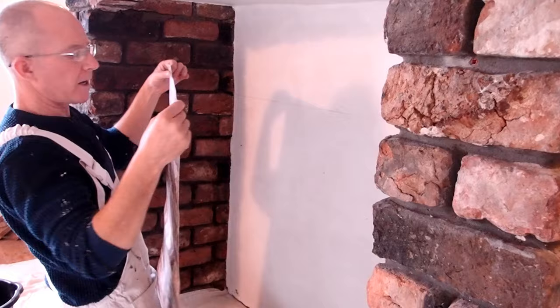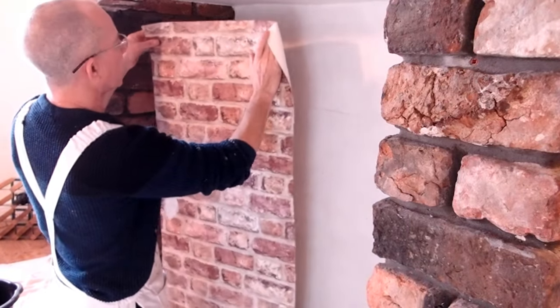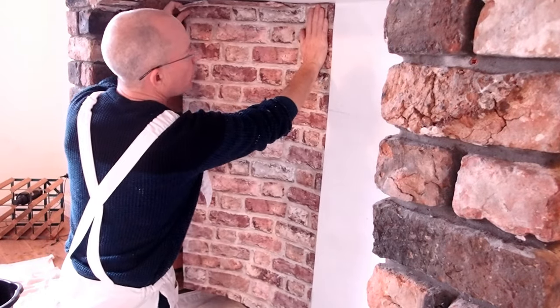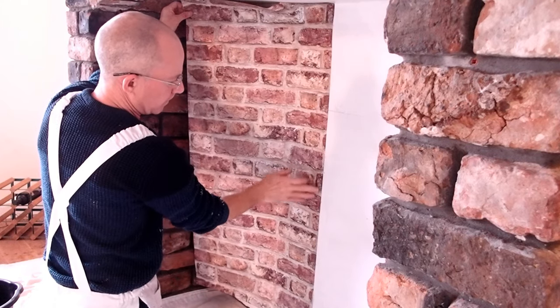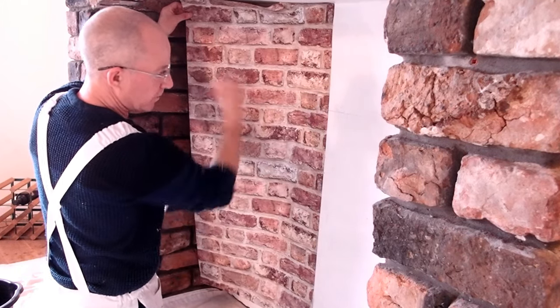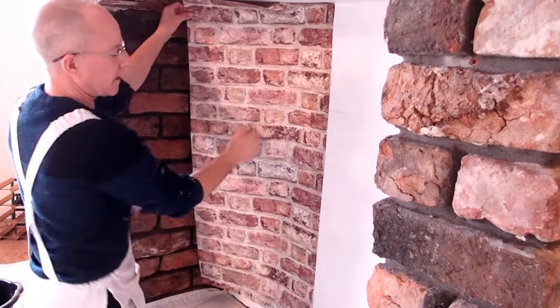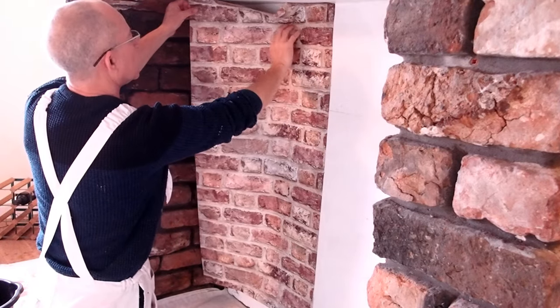Now, never stick your paper just fully onto the wall. Always try and halve it and then find your plumb line. And I know more or less how much overhang I've got on that because I need to match it up to this side. So I can't hang that bit first. So you just kind of need to know where it is more or less.